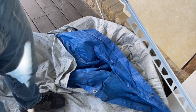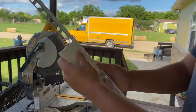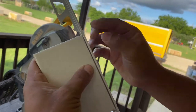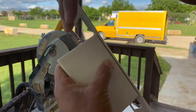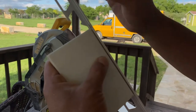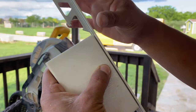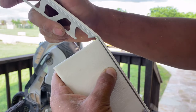Now what I usually do is grab a piece of tile with the factory edge and line it up with my line. Notice I haven't cut the other side to length yet — that's because we want to do our bend first and then cut it to size. Usually if you measure both sides before you do your cuts, you end up with a shorter return.